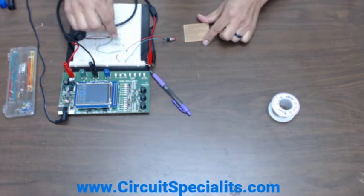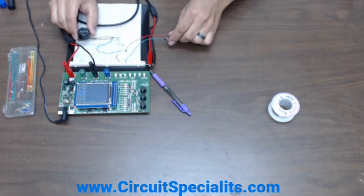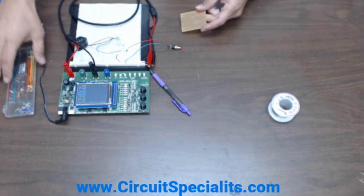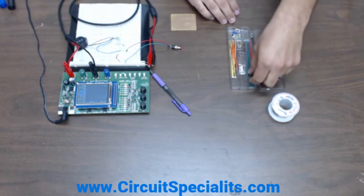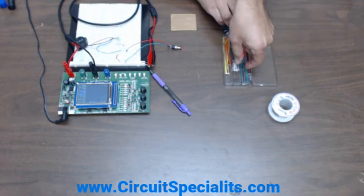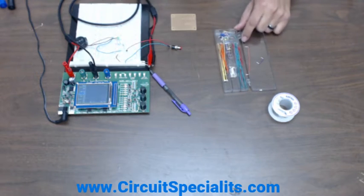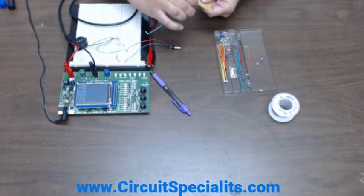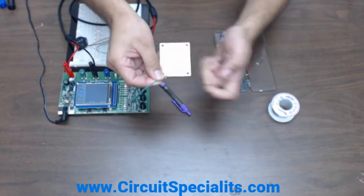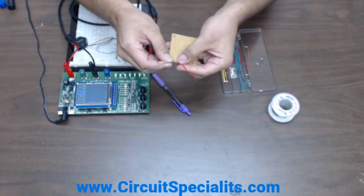What we're going to do today is actually move this circuit — which is basically a doorbell with a light-up buzzer — over to our perf board and try soldering it in. What I like to do first is start off with a positive and negative lead, that way we know where we're tying into. For that I'll be using some of our breadboard jumper wires.